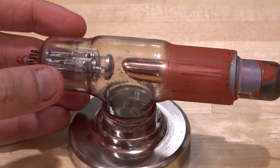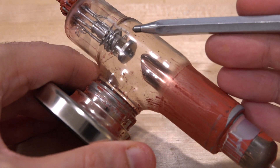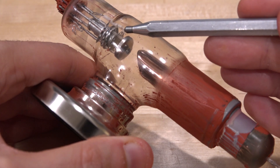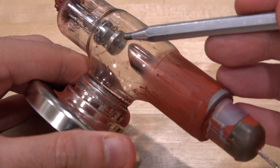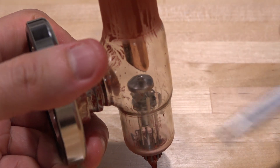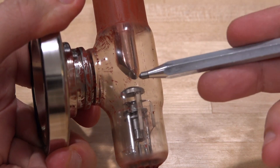Now, if you look carefully inside, you can also see that there are several plates in there. Those are the focusing plates that you have to bias at several thousand volts, and you're going to deflect the electrons and focus them through that pinhole. You can see there's a tiny pinhole in there — it's hard to get this thing to actually focus on it, but there's a hole in there in the middle of that plate. That's where the electrons are going to come in in a focused way.